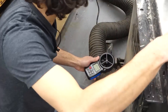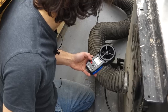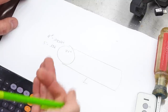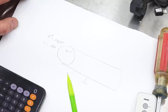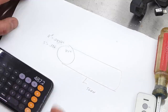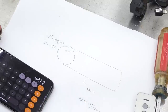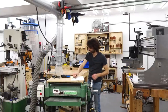That was really hard because there's a lot of air coming through there — a lot more than I was expecting — but around 5,600 feet per minute is what I was getting. Using the calculation for the volume of a cylinder: for a 4-inch pipe, multiply the cross-sectional area in square feet by the wind speed of 5,600, and you get 487.2 cubic feet per minute CFM.